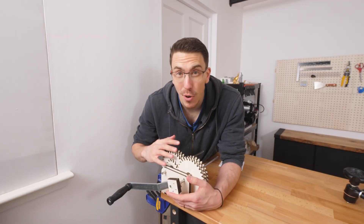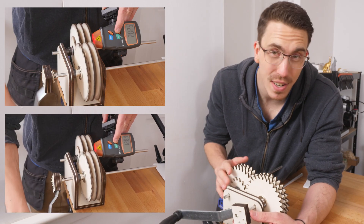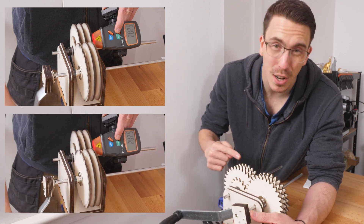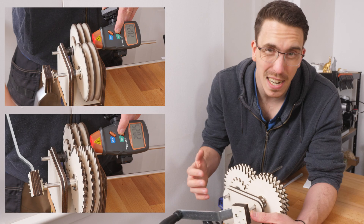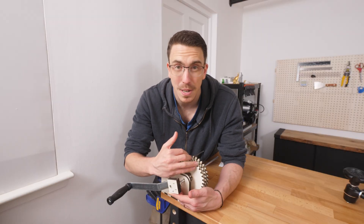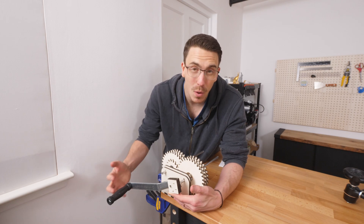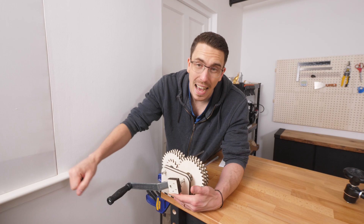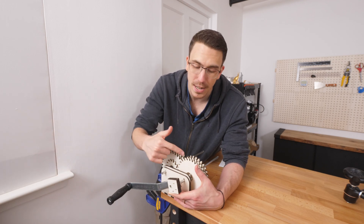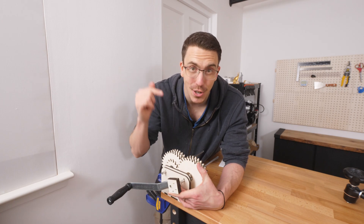With the crank, it wasn't as impressive as I thought. We got to a maximum speed of about 2025 RPM, meaning the back gear was only spinning 33 times a second — not much better than by hand. The main reason was that the turning circle was so big I simply can't turn it fast enough to exceed once per second on the input. So let's attach the drill.